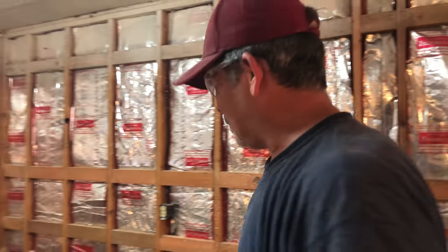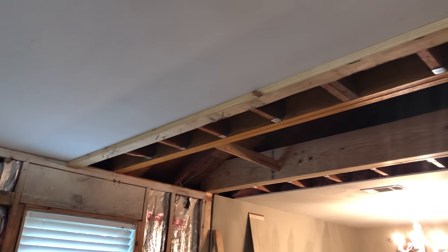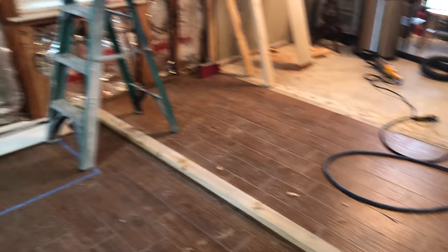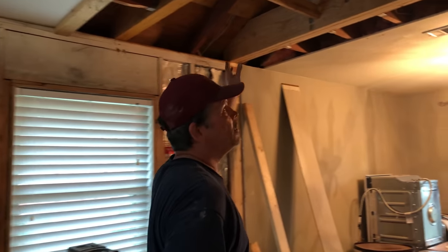How are you feeling? I'm beat but I'm glad it's done. Big project, great job — that was awesome. We just have to remove our temporary top plate and temporary bottom plate, and then clean up. The day's not over until it's all clean. Tomorrow we'll fill in here, transfer our roof load to our new beams, and that'll be the majority of the framing on this one. We'll talk about that tomorrow, but for now let's clean up and get out of here.